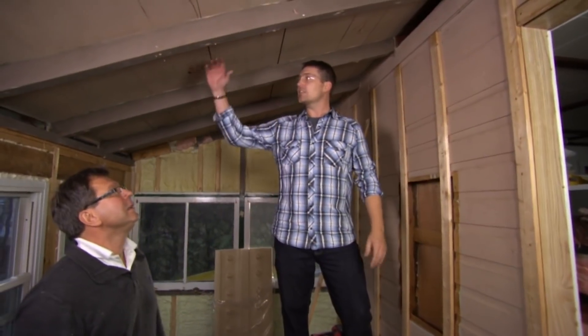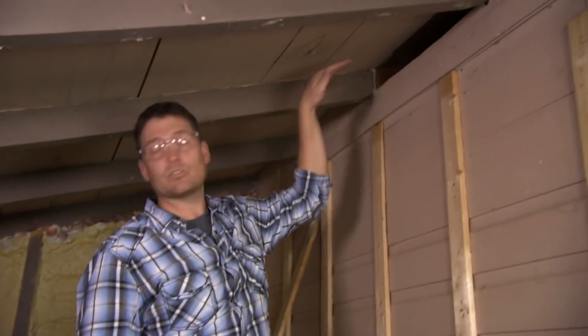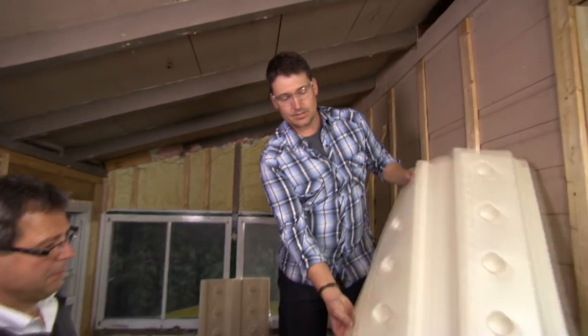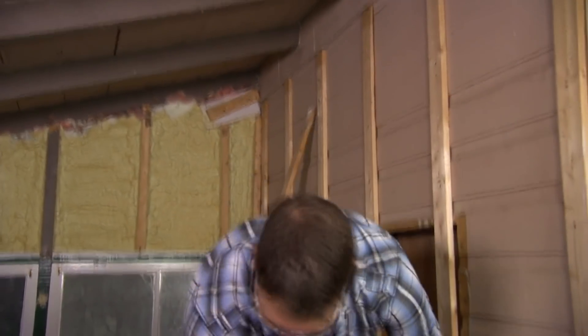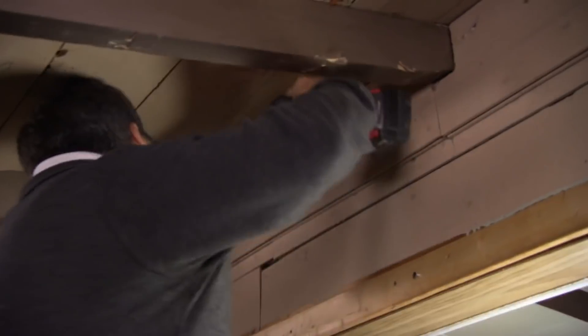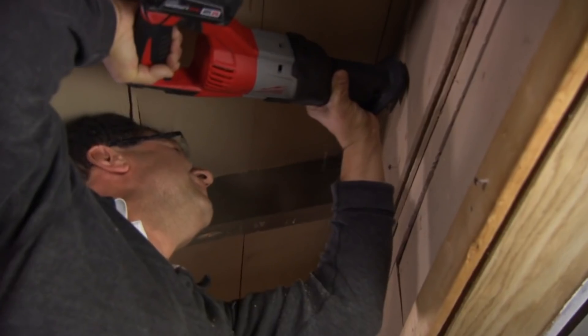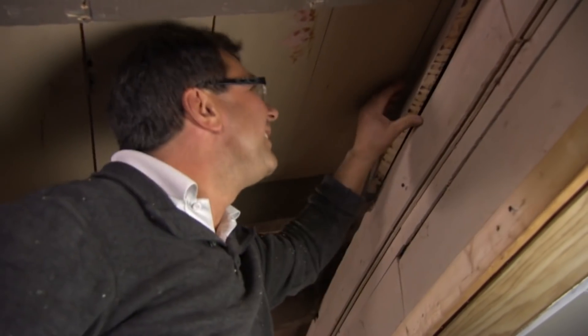Rob, a couple things went wrong here. Insulation, tight to the ceiling, not enough room for air flow. I took out the insulation and it didn't have any air flow, so we have to fix that problem and put some more vents in and get some air flow before we put the ceiling back on. So what I've done here is cut this out that goes into the attic. Now we're going to take these vents — this is going to allow air flow. The good thing about this is you get to cut the rest of them. Have at her. Don't hurt yourself. So we had to cut the boards out in between the rafters to allow more vents to go through continuously, to allow air flow from bottom to top. Look at that. Straighter than your drywall cuts.